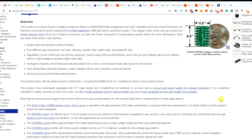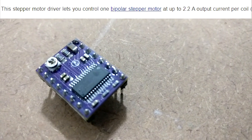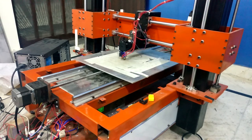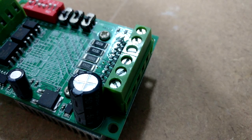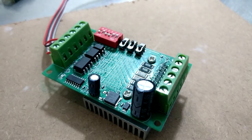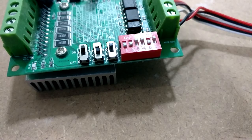During the start of this project I didn't know much about these electronics. When I started facing the problem I read some articles about these components, and after that I shifted to the DRV8825 stepper driver, which is a slightly higher model than the A4988, but it still lacks power because it only provides 2.2 amps maximum. I then thought my motors had some issues causing step skipping — since they'd been used in a previous CNC build — so I bought a new set of motors for X and Y axes, hoping the problem would be solved. But it wasn't — same problem again.